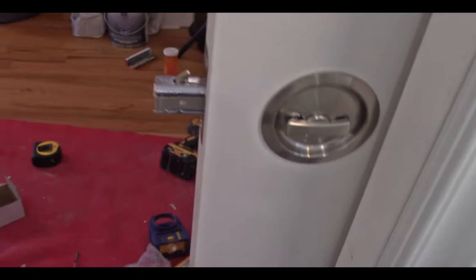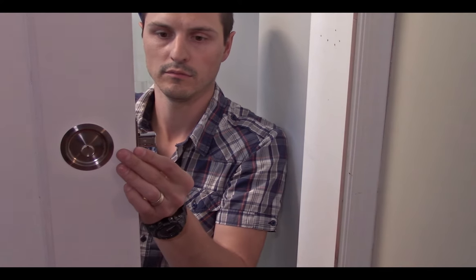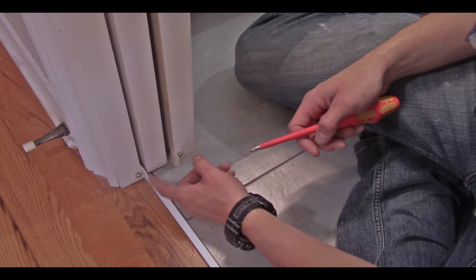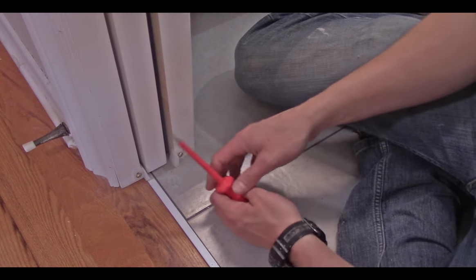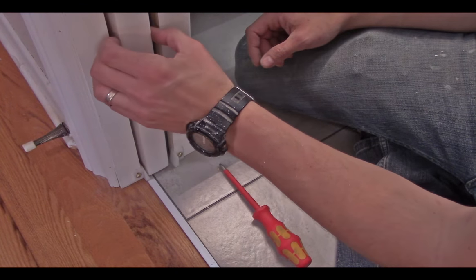It's not any more or less expensive than the other style. On the inside of the door you've got a nice little lever — it just tucks away. So it's my go-to pocket door hardware. The next step is putting the other side in. You'll notice there's a catch plate, and when it's locked it grabs behind the plate and locks the door. If you need to lock it from the outside you can put something flat like a coin in the slot and turn it from that side. I've got a little wiggle in my door so I'm going to have to correct that — these two guides on the bottom keep the door from moving in the pocket and rubbing on the wood.